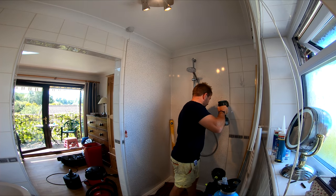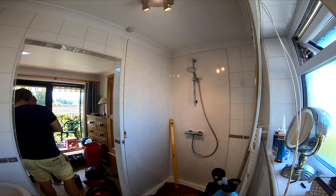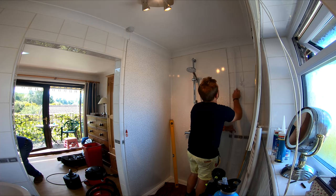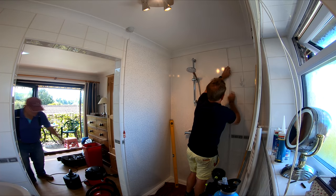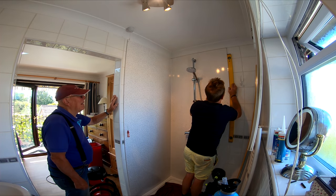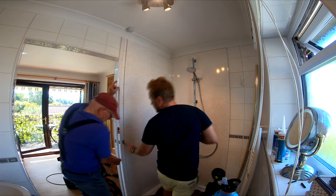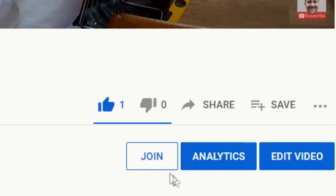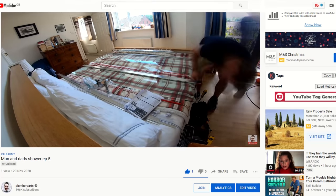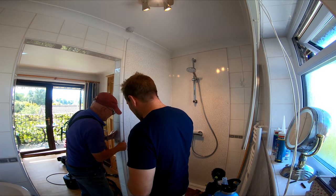I realized at this point it was a good idea to pop the end profiles on, because once we're screwing the side part of the shower screen on, that might pull the wall panel a little bit tighter and we won't be able to put the end panels on. The reason I'm doing this now is that when I start tightening up these profiles, the gap I've left at the back is going to tighten up. You can now join the Al Army for live streams on YouTube — just click the join button below this video. I'm doing a live stream this morning at nine o'clock directly after this video goes live.